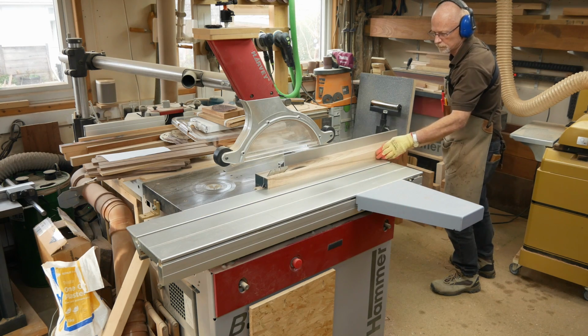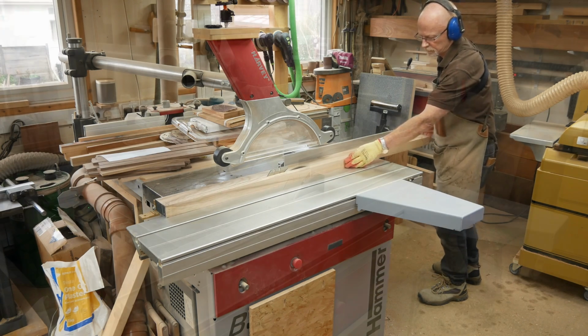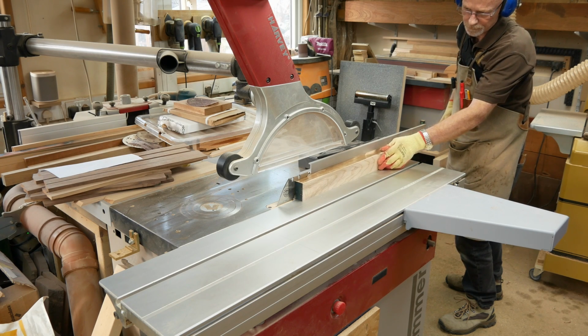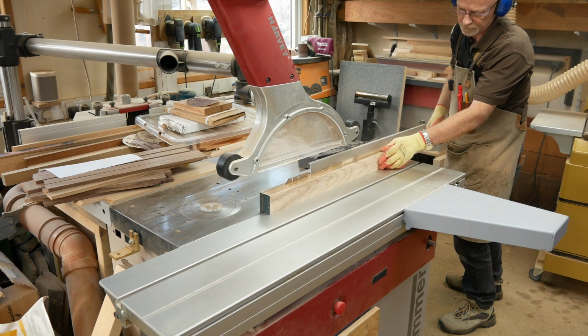So I'm going to start by slicing off a 90mm piece, and then I'll cut 30mm off of this bottom end. Now the resultant 60mm piece I'm going to slice down into 3 pieces, just over 11.5mm. It's about 45mm thick in total. I want 3 pieces after that.